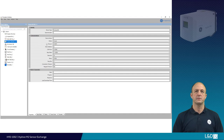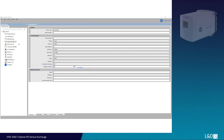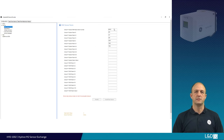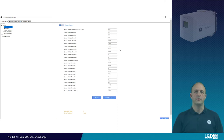Alternatively, with Perception, connect to your device running multi-host software. Configure the communications. Enter Level 2 password 1231 to enable sensor parameter changes. Open the service menu and enter the new sensor parameters as per the GE supply data sheet. When the new sensor parameters are stored and complete, exit the software.